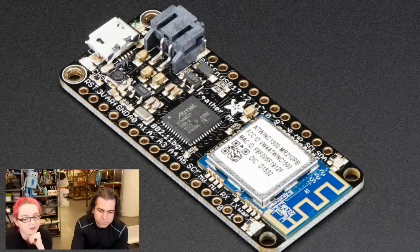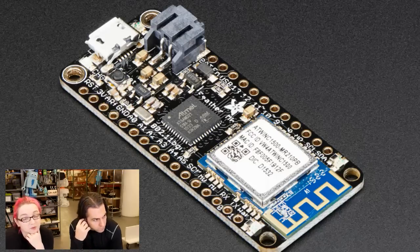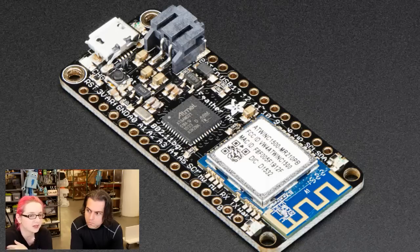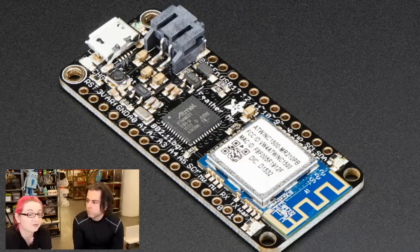It's a really nice Wi-Fi module with very good low power modes. It uses about 12 milliamps on average for the Wi-Fi module when you put it into auto power down mode — and you can still receive and send data. So 12 milliamps is really good for an active connection. It has SSL support with certificates burned into the firmware. It uses SPI and has a full library from the Atmel software framework making SSL connections easy. We just added MDNS support. It can act as a soft AP — its own access point. You can do server, client, UDP, TCP — basically everything you'd want. It's very fast, very reliable, and we really prefer it over the CC3000, especially for the SSL support, soft AP, and fast connection times.